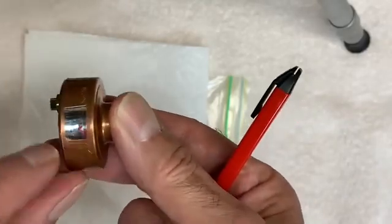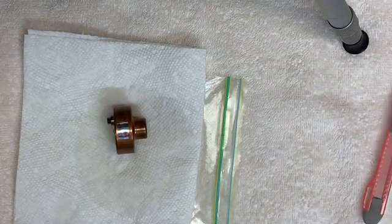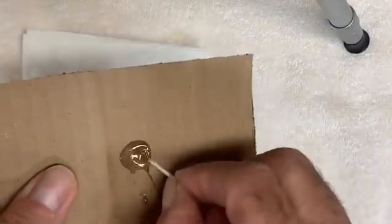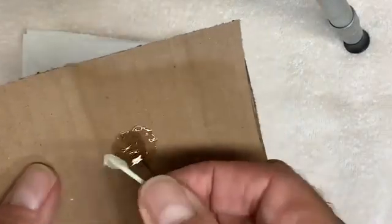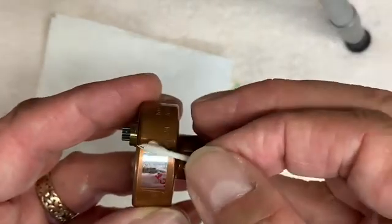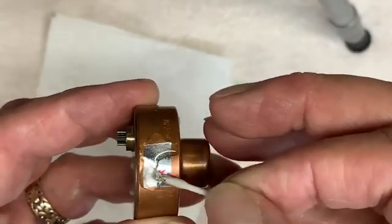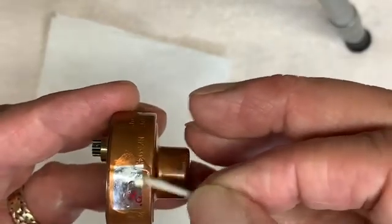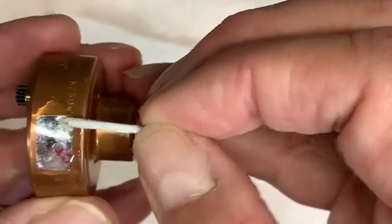What I use to seal the hole is a metal foil tape — the kind used to secure air conditioning ducts or dryer vents. I cut a small piece and just place it over the hole. To guarantee it will not come off and that no oil will leak from around the edges, I cover the whole piece of tape with some epoxy cement — also called epoxy glue — and place it around the edges of the tape. This usually takes about five to ten minutes to set up.